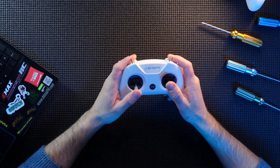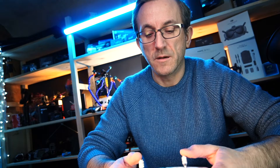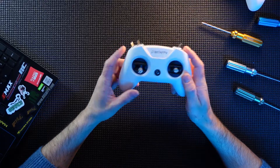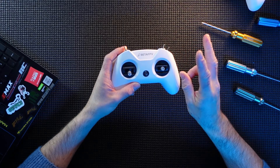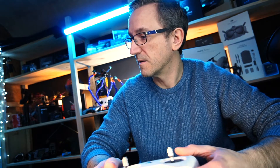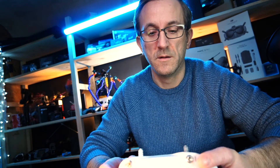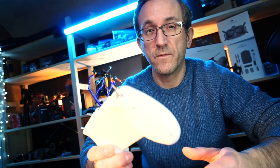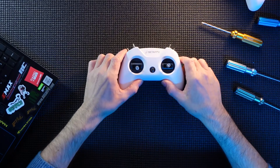There's also a brand new protocol on there. This is the FrSky version and they've got their standard D8 mode and two D16 modes — one D16 mode covers Europe and the other D16 covers the rest of the world. They've also added Futaba on there as well, so they've got four protocols going on this at the moment.